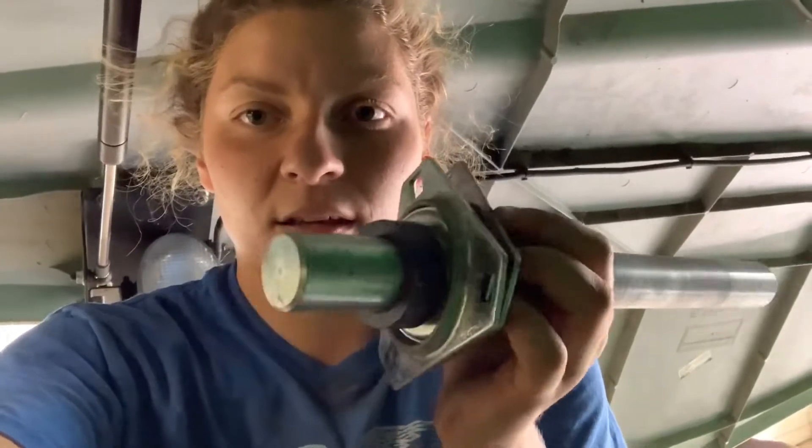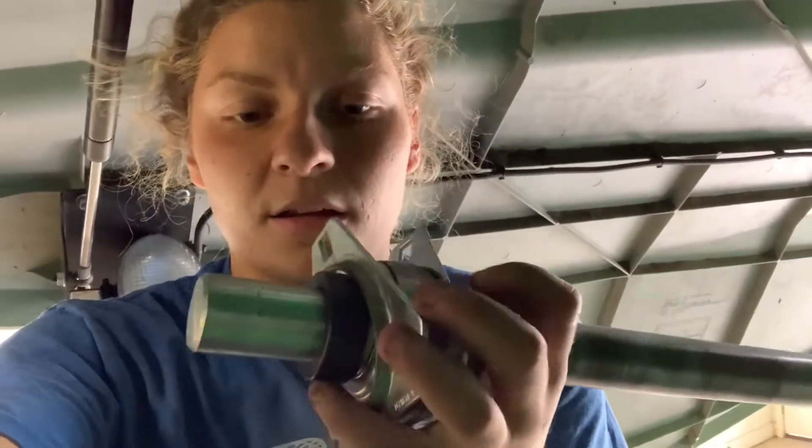So you've just seen me getting this shaft ready to be put back in. So I shined it up, got the bearings on, the collar, and then the flangettes. And now we're going to put that in up here. And you've also seen my dad in the last video.